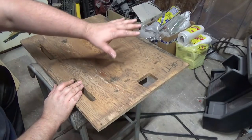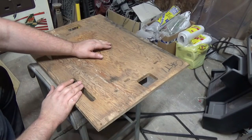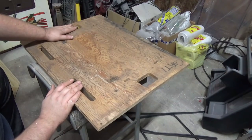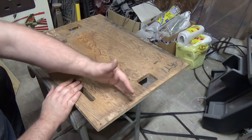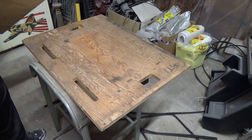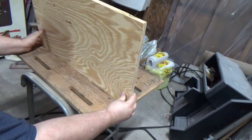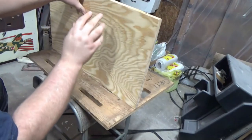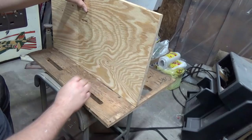So far I removed the 13-inch Wells Gardner 4600 monitor that somebody rigged up. I also removed the hacked Tidal power supply that somebody rigged up. So now I have a bare board. There's another board that's supposed to be right here that's missing. The monitor's on one side, and on the other side is all the electronics — power supply, the CCPU board, the sound board, and so on.